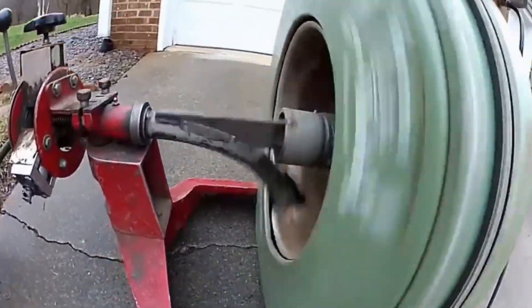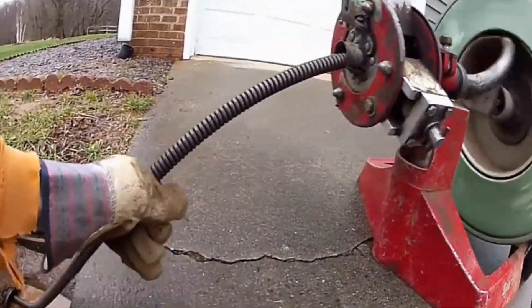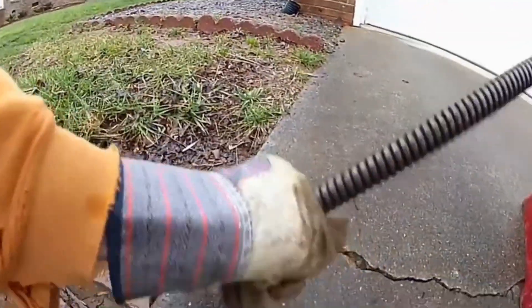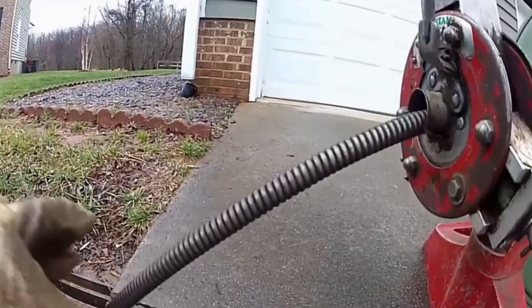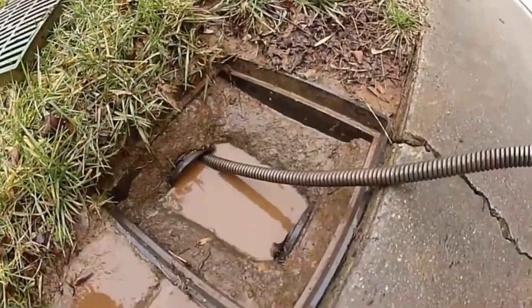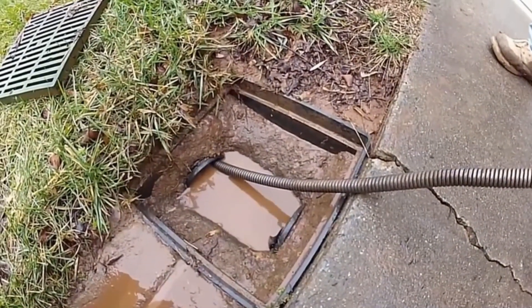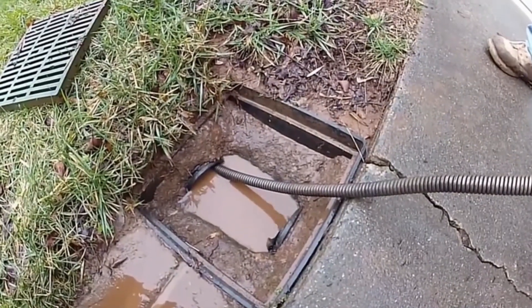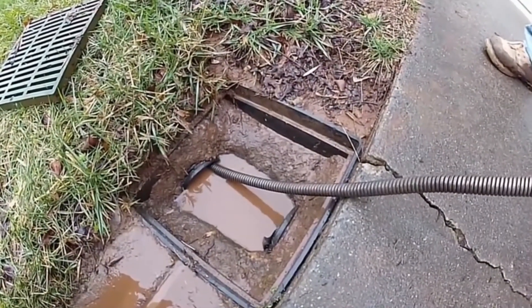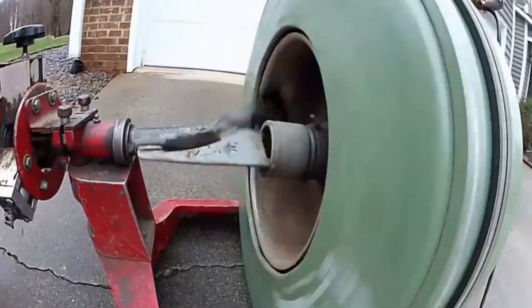If you've got an existing French drain or a downspout drain that stopped working — whether it stopped working two years, ten years, or twenty years after it was installed — the problem is not that the system failed, but there's a problem with the system. It's probably got tree roots or perhaps a section of broken or collapsed pipe. The best way to handle this is to try to clean your line and find out what the problem is. Of course there are times you need to replace the system, but a good honest contractor will always try to clean your line first before trying to sell you a gigantic new system.